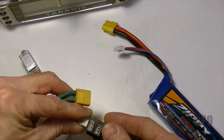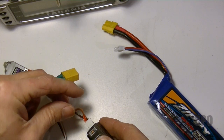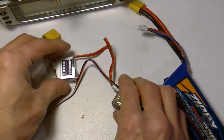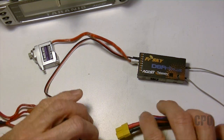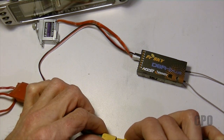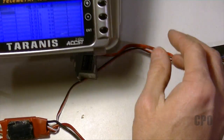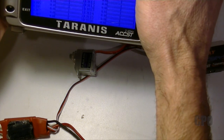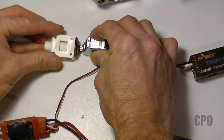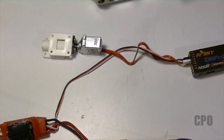There's one other thing I want to do before the final installation of the yaw assembly and the servo, and that's to center the servo. To do that, I hook the battery to an ESC and then my receiver, and make sure I have a default model in my transmitter that will set that servo position at center point. With the servo powered, I'll connect it to the yaw mechanism to make sure it's exactly where I want it before installing it on the tricopter.